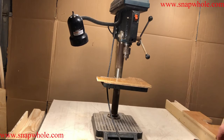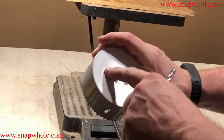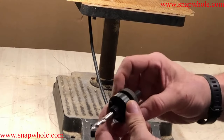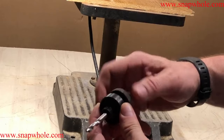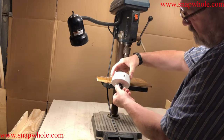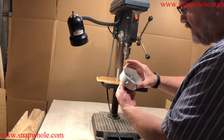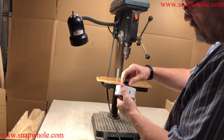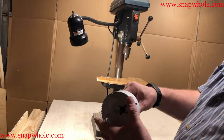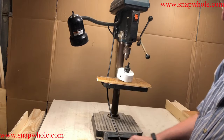There are two types of arbors. I chose this one that has pins that fit into holes to reinforce. What you do is turn up the top and that pulls the pins out. Then you take the cup, turn it onto the arbor, line up the holes, and screw that back down in. That's how you get the pins in the holes to reinforce it. Now I'll put that in the drill and start drilling that hole.